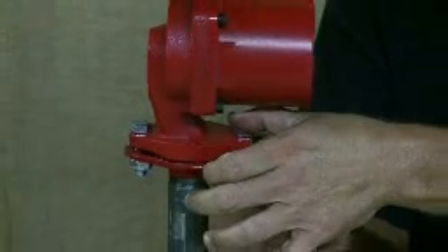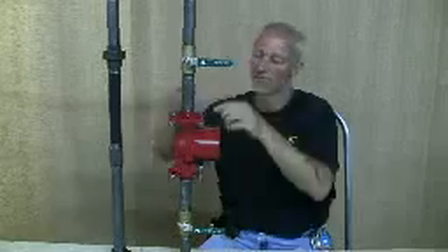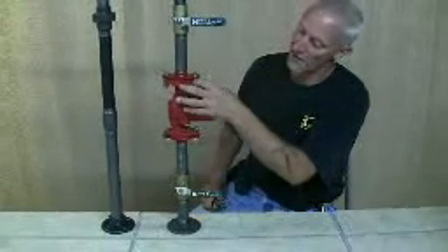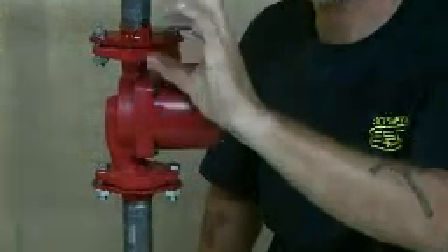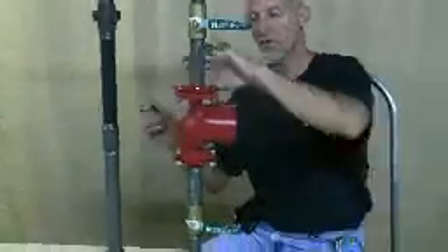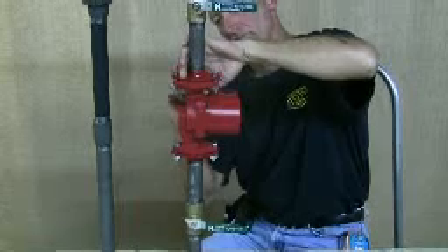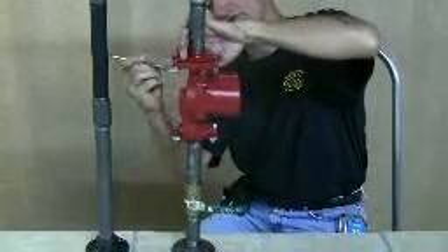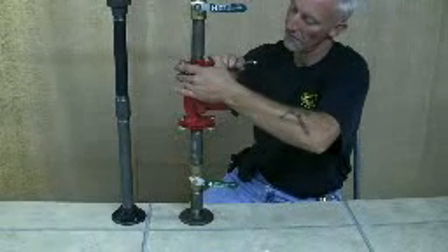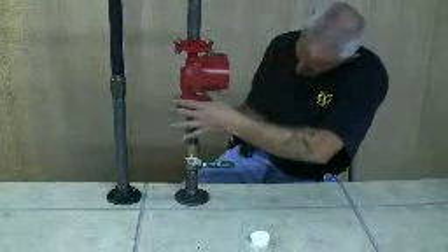The key to tightening the nuts and bolts on your flanges: first hand tighten them as tight as you can. These ears on the pump flanges are very fragile, so you don't want to over-tighten them. You just want to compress the rubber gasket just a little bit so it doesn't leak. If you turn on the water and it starts to leak a little bit, just give them another little quarter turn. About one to one and a half turns with the wrench to snug it down — just enough to compress the gasket.